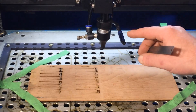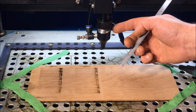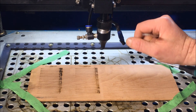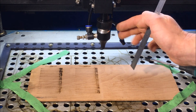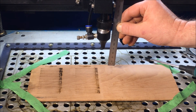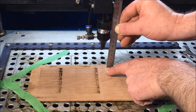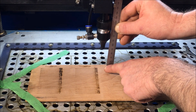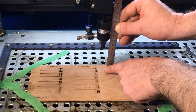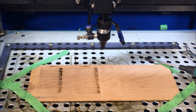My 76mm lens was the wrong diameter for the other nozzle, so I had to make something up and the long nozzle that came with it didn't have the thread properly. It will sort of work but it's not ideal — it will demonstrate the final lens anyway. With 76mm focal length, the focal point is around about 40mm from the top of the nozzle, so somewhere around there is where I'll find my focal point. I'll do the same as the last two lenses and make 15 lines from about 55mm to 35mm.